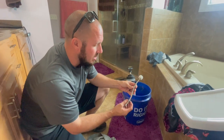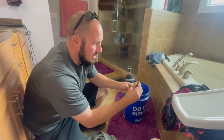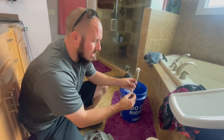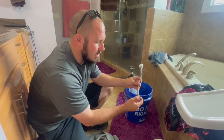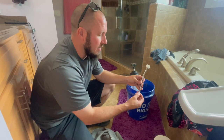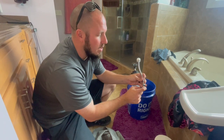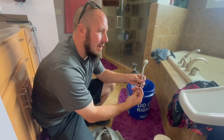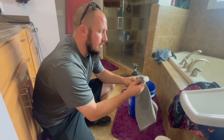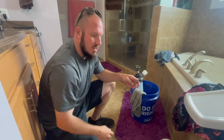So this is what I was talking about earlier in the truck — a rigid line like this. They come with this flare already on the end and an o-ring, and then you just cut it to length, cut it with a pipe cutter, and put your ferrule and compression cap on and tighten it down. This is all fine until you replace the toilet and it's just a little bit higher, so it no longer seats on the ferrule. You could pull the ferrule out a bit more, or put a new rigid line in, but we just put in a flex line and we'll never have a problem with it again.